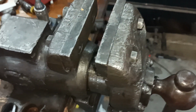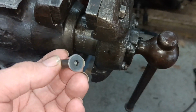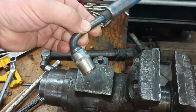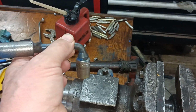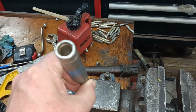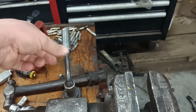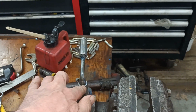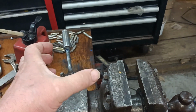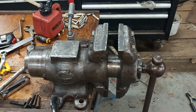So there it is. It's looking quite handsome, and these ones are different. They've got a hex key head in there, so they're nice and strong. 12.9 grade, very strong. The other thing that I did was this little key thing that I made or modified from scrap parts, and it's got a socket on there that fits that, so that can just sit on there now. It's actually a hex drive, which is a bit unusual, but yeah, so I can undo the clamp and tighten it up. That'll just stay there, and it swivels when I want it to.